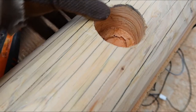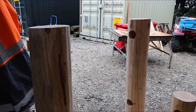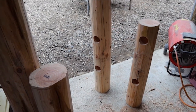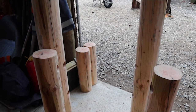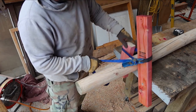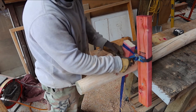Once this is all sanded down and these edges are nice and neat, and we've cut a nice tenon to go in there, I think it's going to look good. I've done all the mortises for the bed head and bedstead, and what I'm going to do next is start creating the horizontals. I've rigged up this little clamp system to hold the pole — it's fixed on one side, moves on the other, and I've hooked up an old tie-down strap.